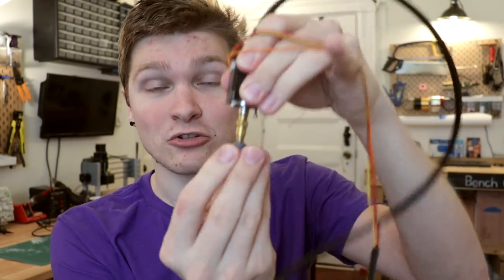There also needs to be a place for the nozzle tip exchanger. The nozzle setup I'm using is awesome because it just press fits these little nozzle tips onto the actual assembly that lets air pass through, which gets rotated by the stepper. If you have a little holster that this can just pop into, grab a different tip, slide out, and then go pick up different sized components — it all happens automatically. It's like a little passive tool changer. That needs to live somewhere too.